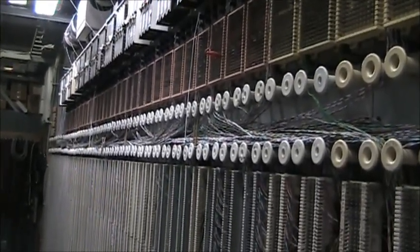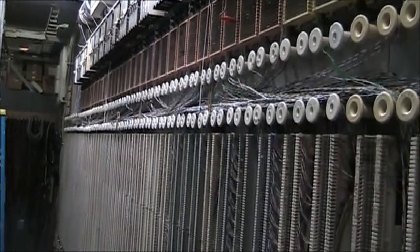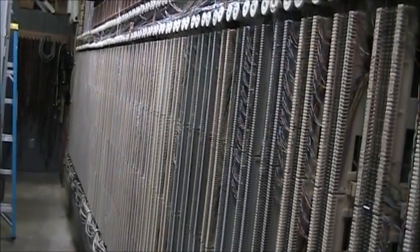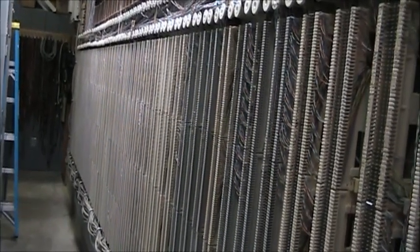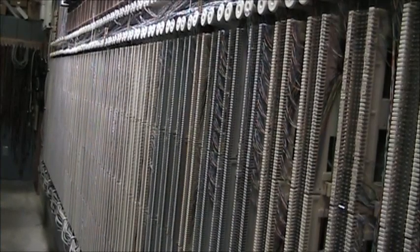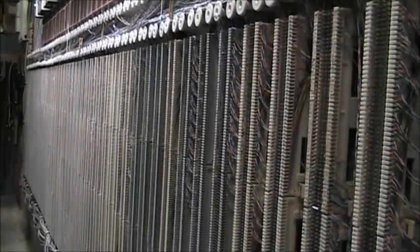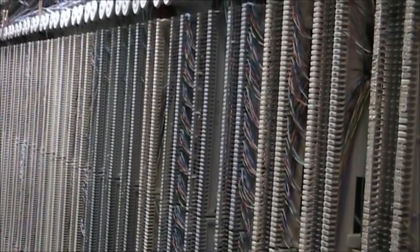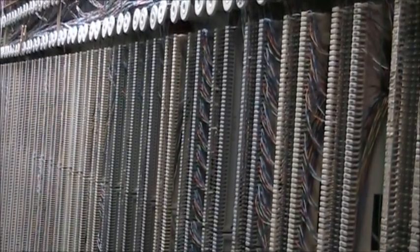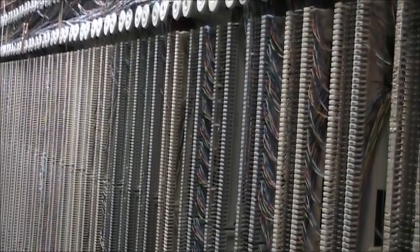On this wall there are 58 vertical rows of 66 blocks. These 66 blocks have terminated on them several hundred pairs for the dial tone from the switching system, tie cables to other back boards located in the building, as well as several hundred key telephones tied down to these blocks. The gray blocks are connected to some 584C panels. Due to running out of wall space, I terminated 105 lines of the 584C panels on the M125 blocks, which is not a typical installation.